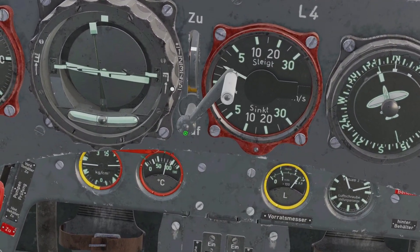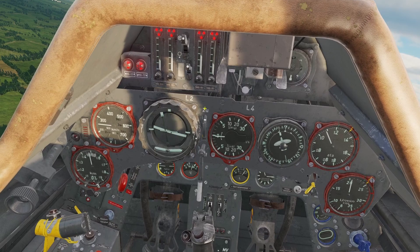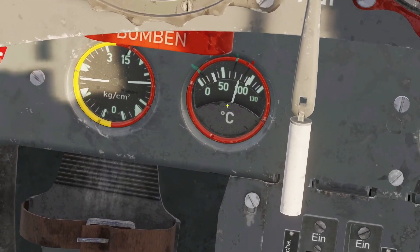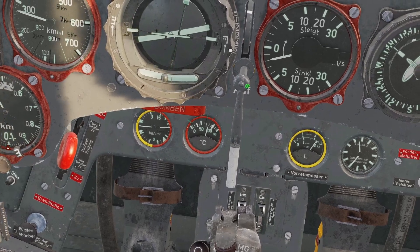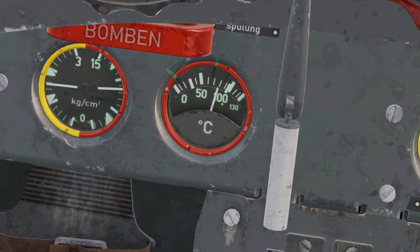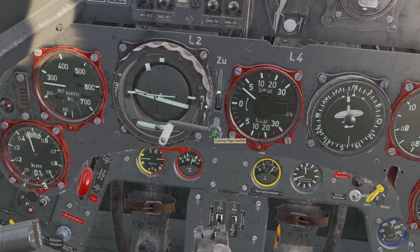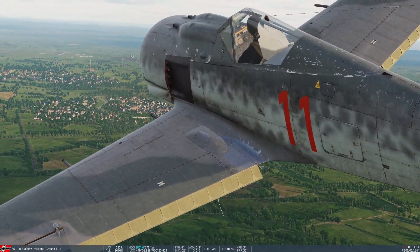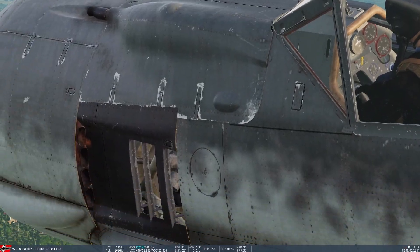Next, there is this switch right here. When I move this handle, you can see this white line is moving up and down. This lever opens and closes the flaps on the side of the engine to control the engine temperature. There's a red gauge which shows you the temperature of the oil. If the oil temperature is below 100 degrees Celsius, you want the flaps to be all the way closed, so you turn the handle all the way left. If the oil temperature goes above 110 degrees Celsius, you crank the handle to the right to open it and cool the engine down. Right now it's around 70 degrees Celsius, so I'm going to close the flaps all the way. You can see right now they're closed, and if I open them all the way, you can see they are open.